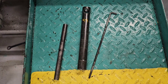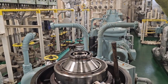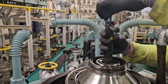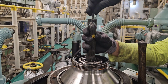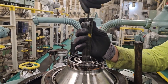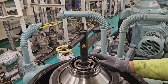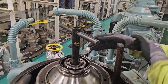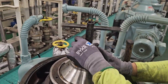Next we have the special tool called the cap nut spanner — it is a special tool to remove the bowl locking nut. You set the spanner on the cap nut and thread the threaded rod of the spanner into the hole at the head of the cap nut. Then you turn the handle of the spanner — the first turn would require a tap by a hammer — and then you draw it up together with the nut removed. That is the nut.